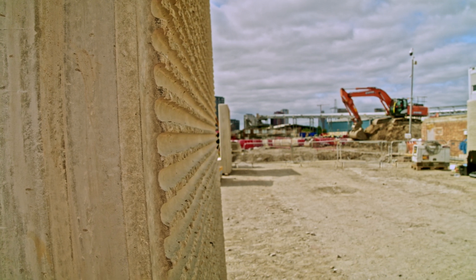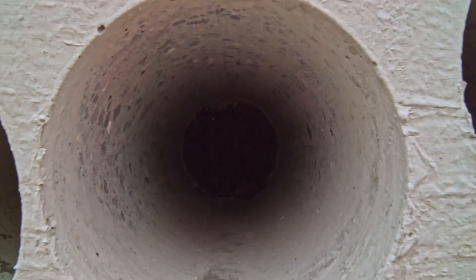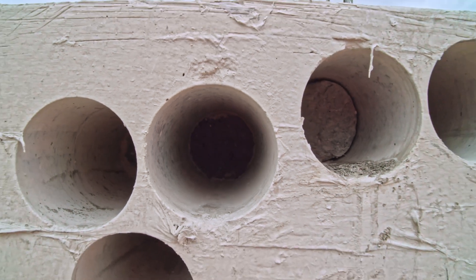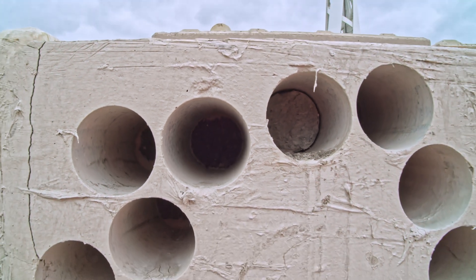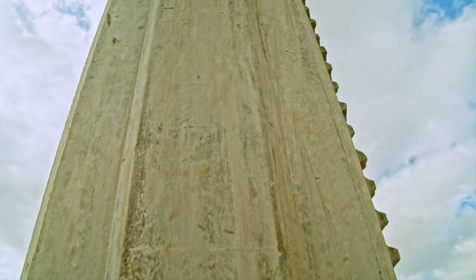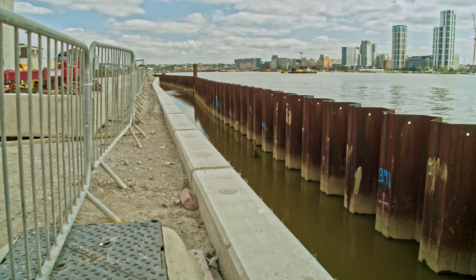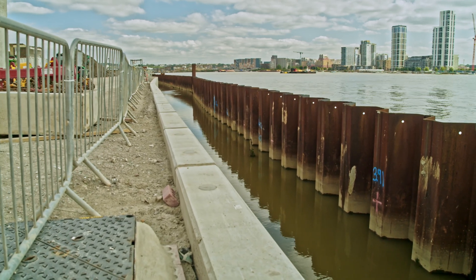You can use it to quickly carry out scans of reinforced concrete to evaluate the internal fire protection time rating of a building. You can use it to investigate cracking in beams and whether that's related to not enough or even too much cover. You can also use it to scan reinforced concrete structures in marine environments to confirm whether the required protective concrete cover has been achieved.